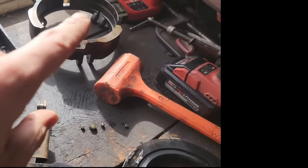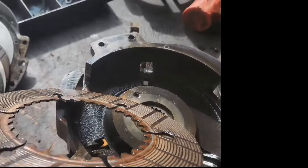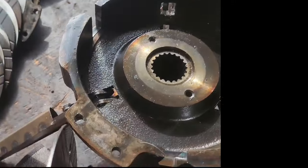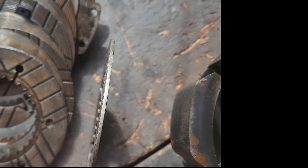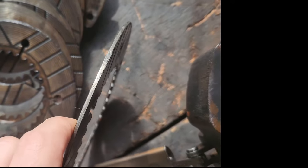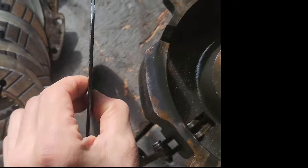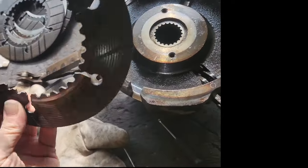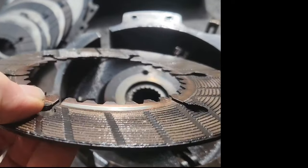One more little thing on the ridge that's inside of there. Not exactly sure what caused it, but this is the plate. Somehow that got bent in there. And if we look on the edge, you can see maybe, like right here especially, is where it was not riding in there plumb, and was catching that ridge all the way around. You can see that side, it wasn't. Just visual inspection of these other ones, this appeared to be the only one that was rubbing. And, like I said, it's bent right there. You can see the wear mark on it.